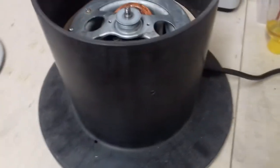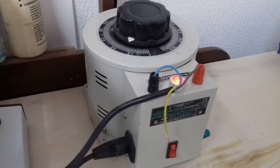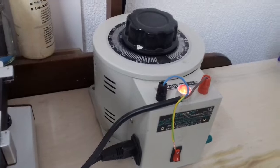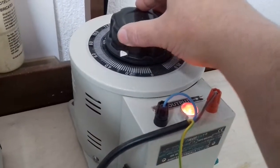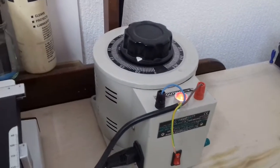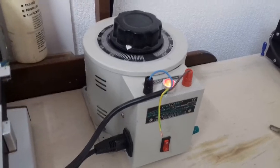All in all it's a fairly cheap item to make. The power source is a standard Variac — you can pick these up for anywhere from £40 to £100 on eBay. This one is a brand new one at about £100. Because it's an AC motor, you can use the Variac as a speed controller as well. This one's set at about 24 volts to give a nice even speed, but you can speed up or slow it down. A very handy item to have — I'd recommend anyone to get one.